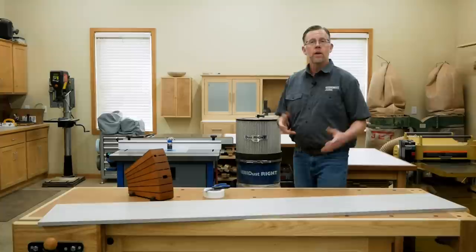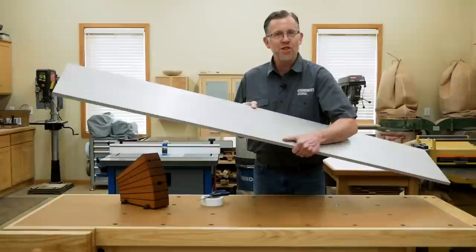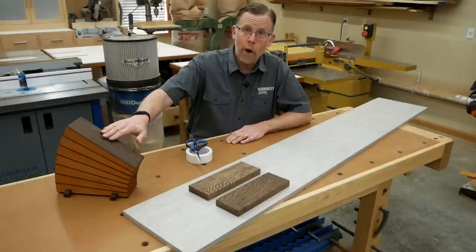For this knife block, all I needed to tackle this thin planing job was a flat piece of 3/4 inch scrap board. I'm using a melamine shelf board here and some double-sided tape. This melamine is gonna serve as a carrier board for the wenge — it's gonna provide the stiffness that the thin wenge won't have anymore, and it's also gonna provide the extra length needed to plane these short pieces safely.